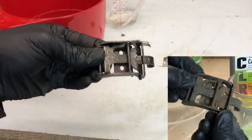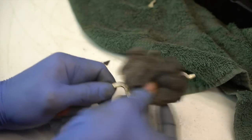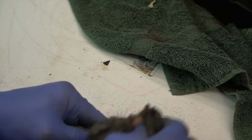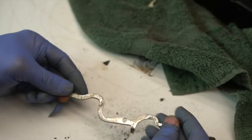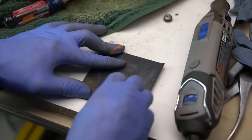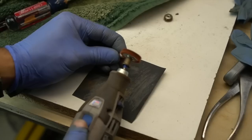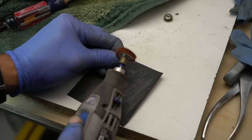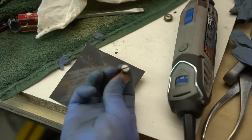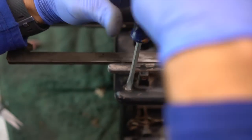There are a few chrome pieces on this typewriter, and I learned that steel wool really shines up chrome. All I needed was some fine steel wool, rubbed on for a couple of minutes, and it's shining like the north star. For the plethora of bolts and screws, I used 500 grit sandpaper to sand off the rusted layer, then used the Dremel buffing tool to shine them up and make them look brand new. After they're fully buffed, proceed to installing them and moving on to the next.